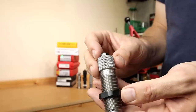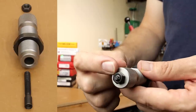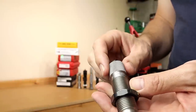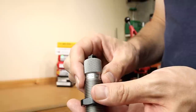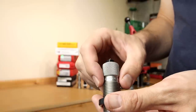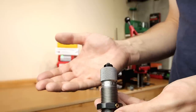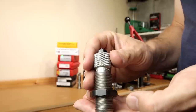This is the RCBS seating die. The seating stem adjustment on this die is slightly different — it has a nut lock ring and a threaded rod that goes to the die body to adjust your overall length. One of the biggest differences for this particular die is that it says TC for taper crimp. This die can be operated like the Lee without providing a crimp, but it also has the ability to crimp the case as well if desired, or you can back the seating stem out and do the taper crimp in a separate step.